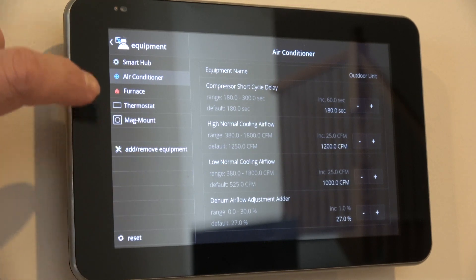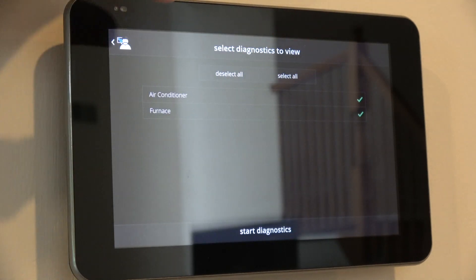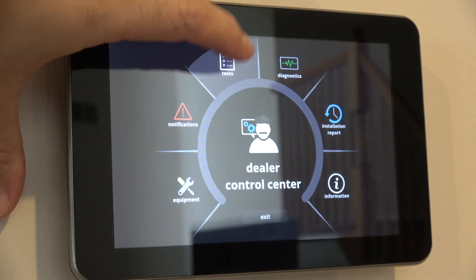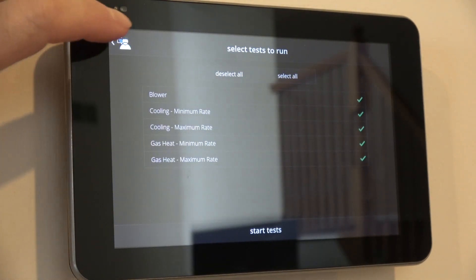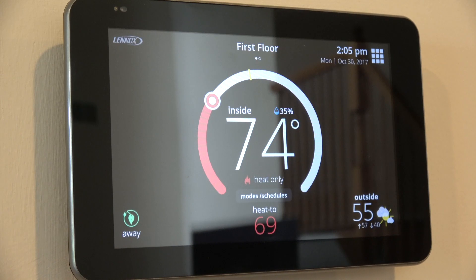I found running the tests and diagnostics quite useful — I can run both units right now. I'm currently in heating mode because of the time of year. I also added a temperature sensor on the output side of the airflow that the dealer did not install. This gives the system better data for dehumidification, which I have set to dehumidify downstairs in the summer.